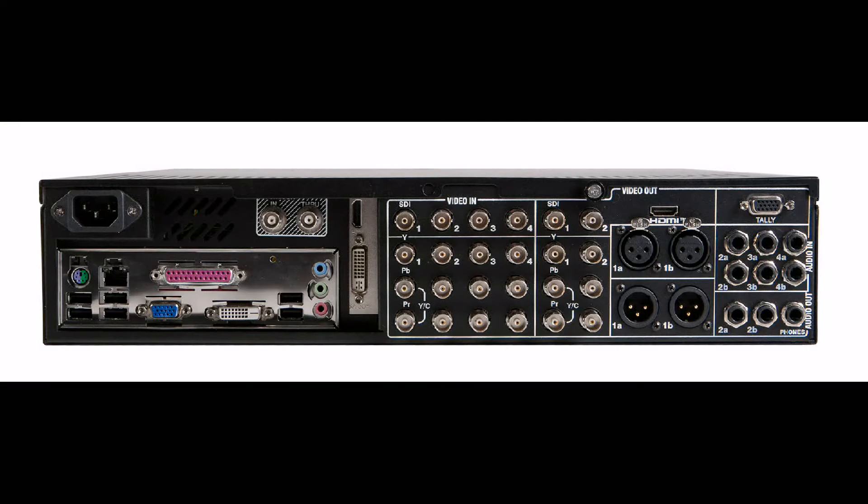This allows the 3Play operator to switch from output A to output B out of one output from the back of the 3Play. This network connector can also be used if you're using a TriCaster as the switcher. Any high definition TriCaster running REV4 software or later will allow you to bring both independent outputs of a 3Play 425 or 820 directly into the TriCaster through the network inputs, across the ethernet cable. This means you still have all the live video inputs available in your switcher, bringing your instant replay outputs from the 3Play in through the network inputs.